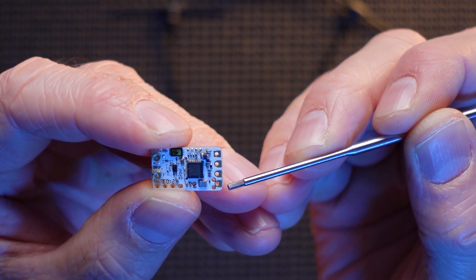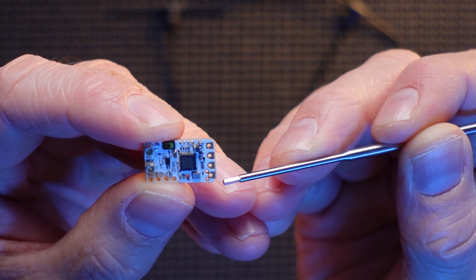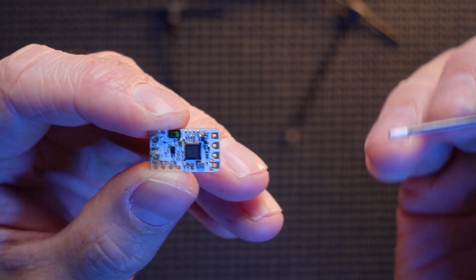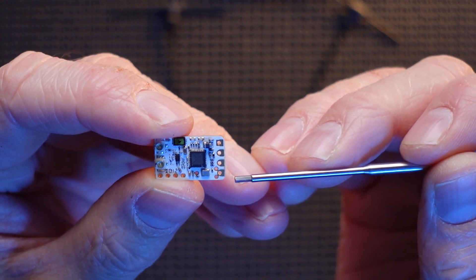So that's TX and RX at the bottom — channel one and channel two. Just like Crossfire, you will be wiring the TX pad to RX, and the RX pad to TX. So exactly the same as Crossfire. If you're used to Crossfire, you'll have no problems whatsoever. Just remember it's always opposites — TX to RX, RX to TX. Dead simple.